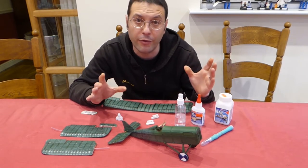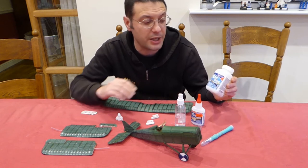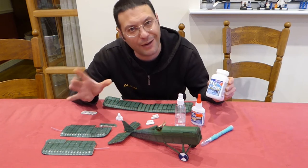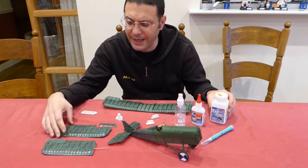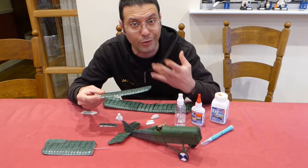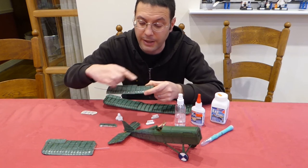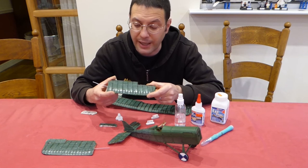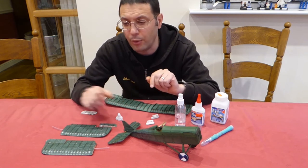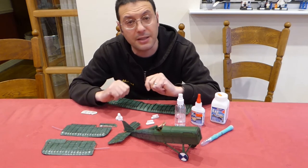As the moisture evaporates from the covering it shrinks tight. Then to seal the surface I chose Easy Dope from Deluxe Materials — I chose this because you can wash your brushes out with plain water and there's no smell while it dries. I did however have to do this in the workshop. I made a little mistake in that I got the grain of the tissue wrong on the upper surfaces of the wings — tissue paper has a grain like wood does, and it's supposed to go along the panels. On the upper surfaces I made a mistake and it goes across instead. So as the dope cured and shrank it bent the panels out of shape. It was an easy fix however — using a small amount of pressure on a flat board and a hair dryer made the doped tissue covering behave a little like heat shrink covering, and as they cooled they remained flat.